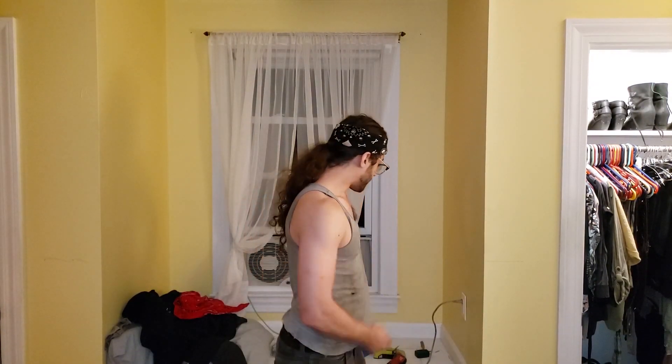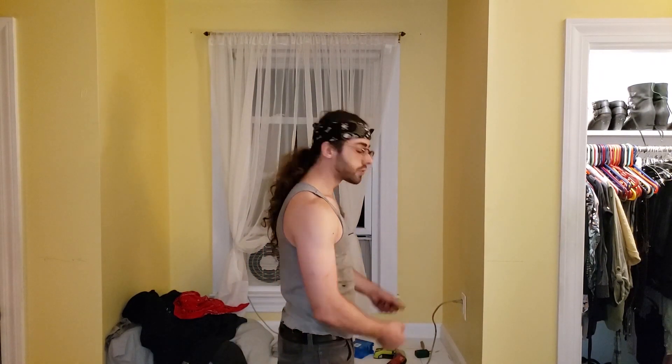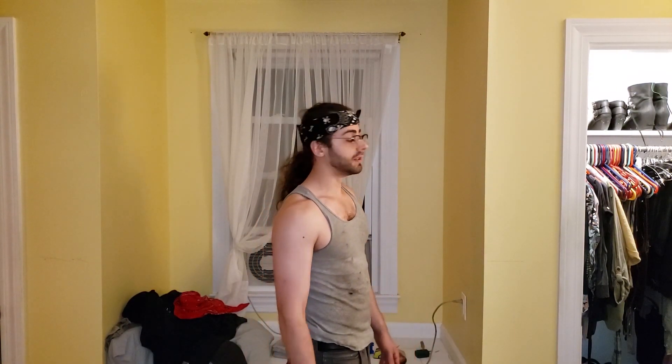And that's how you install an outlet — at least one of the many ways. I'll put a link in the description for most of the tools I used. It's always a good idea if you DIY this to invite an electrical inspector to inspect your work, make sure you didn't mess anything up, and confirm you're following not just the latest NEC code but also any local town bylaws, which can sometimes be different. That's all I have for you — punch that like button and electrocute that subscribe button, and I'll see you next time.